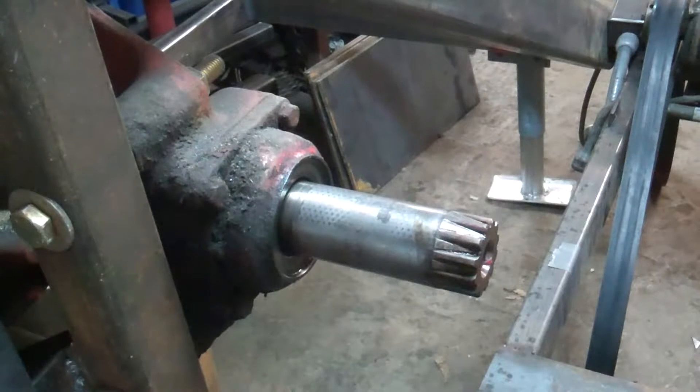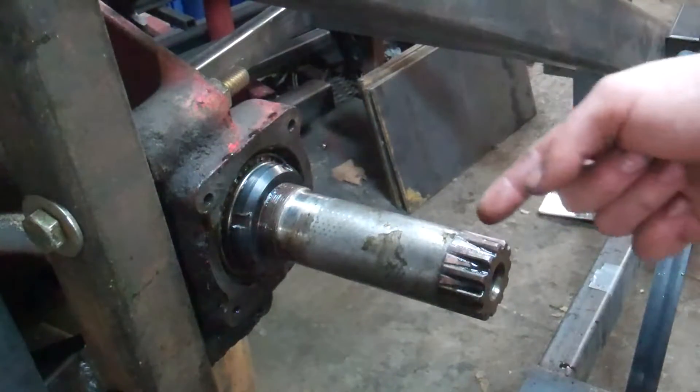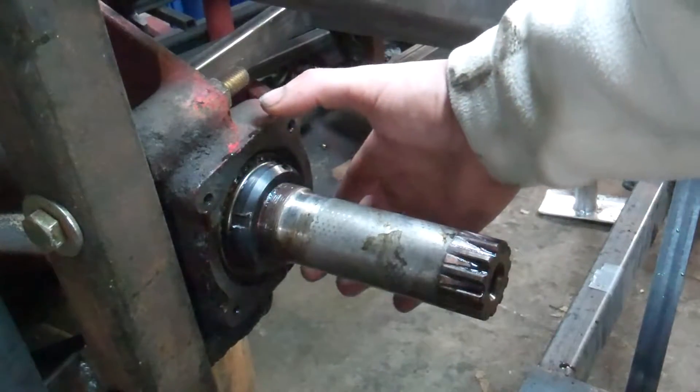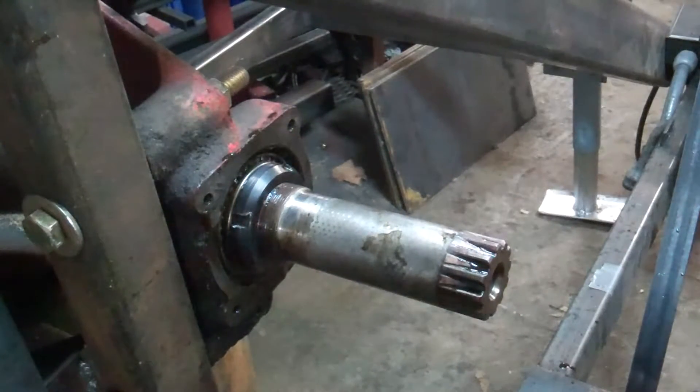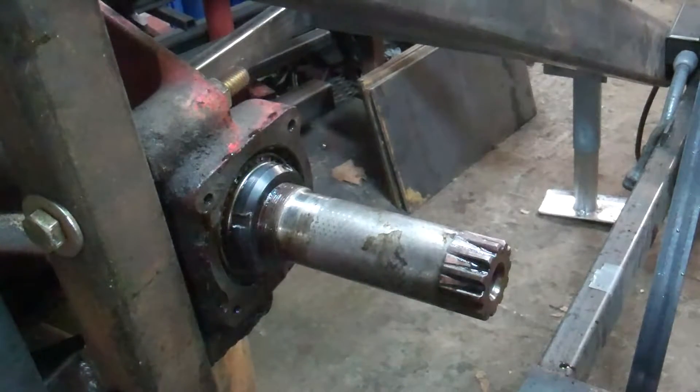If I can get it any better, then I will make a comparison video so I can see if we got anything done. Here is the shaft. I've taken off the bearing cover. This is what we took off so far. After the flywheel came off, there were these three washers — they slid off. After that, that cover came off, which I've got set over there to drain.